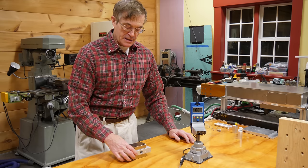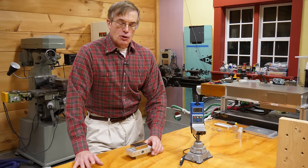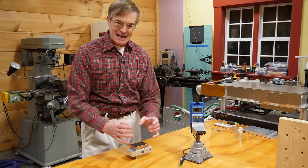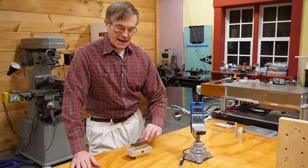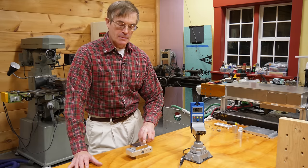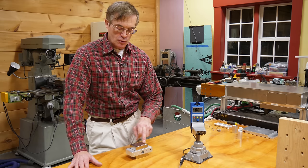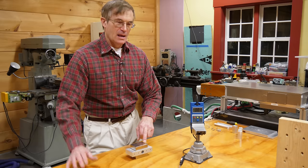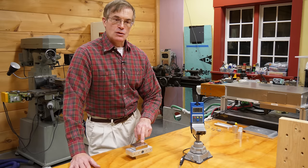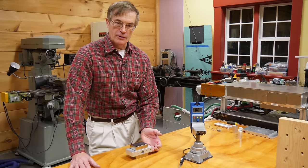The trick is to add a guiding yoke — magnetic material that can guide and hide those field lines. There is a property called saturation: steel can only contain so much field strength, or essentially so many field lines. In these most powerful N52 magnets, that saturation point is similar to the strength of the magnet. So if I have a 2-inch by 3-inch magnet — about 5 by 7.5 centimeters, essentially six square inches — I need roughly six square inches of cross section in my steel in order to guide the field around in the yoke.